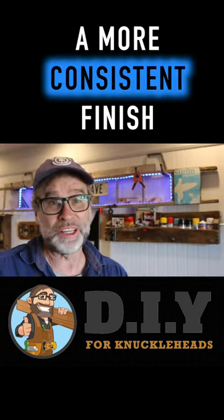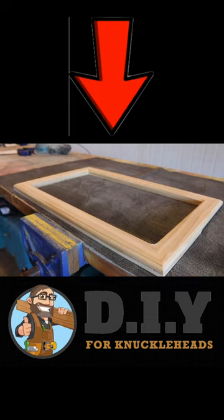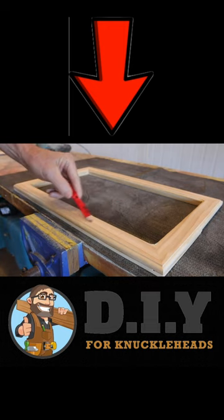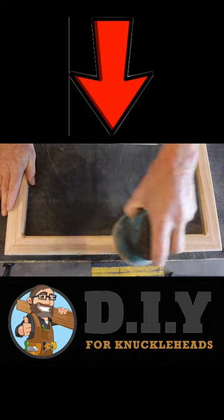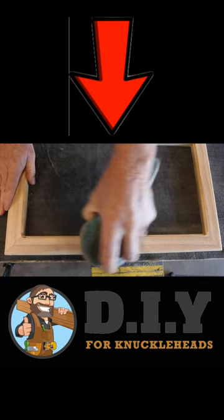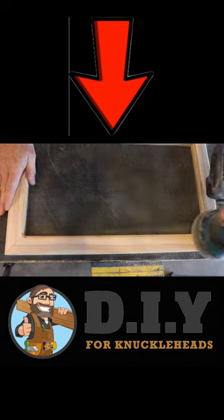To help you achieve a more consistent finish, with your sharp pencil, lightly scribble over all of the surface. This will ensure that you spend equal time on all of the areas. Then reapply the pencil marks after each grit until you're done.